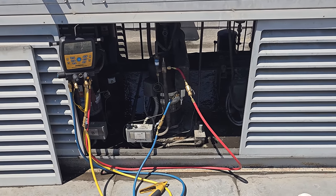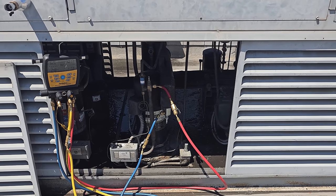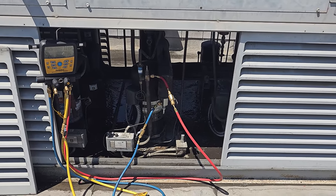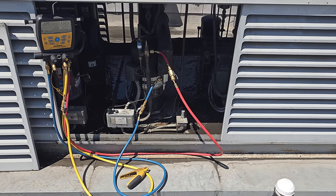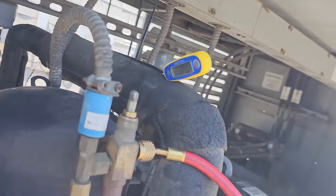You still don't just assume — we're checking everything out, we're watching it operate. The box is at 42 degrees now, so it's coming down and temperature feels better in there. Contactor seems fine. There's no voltage drop across the contactor. Current seems okay. Things are looking good — not seeing anything crazy.